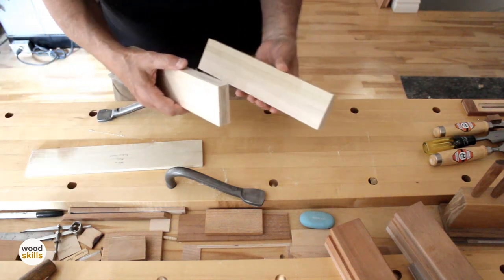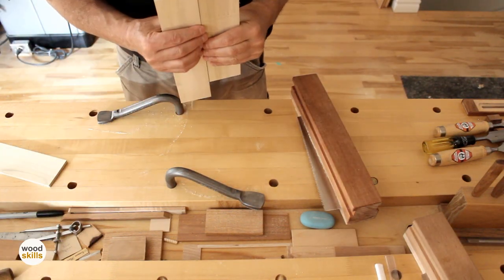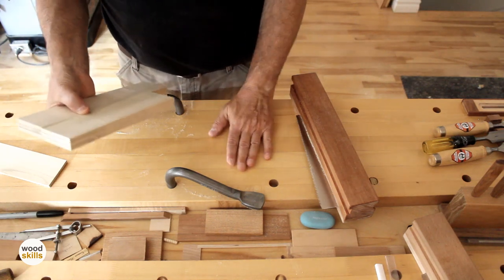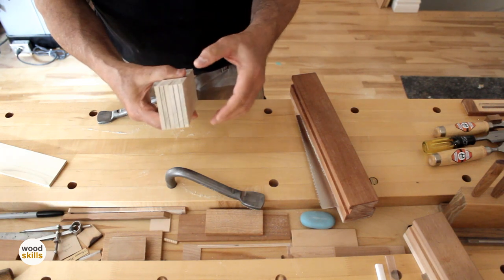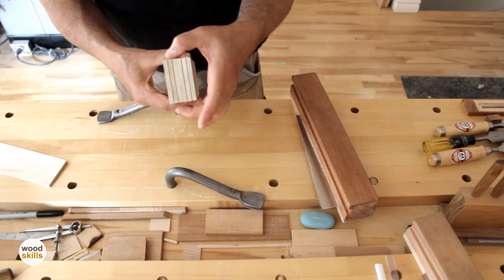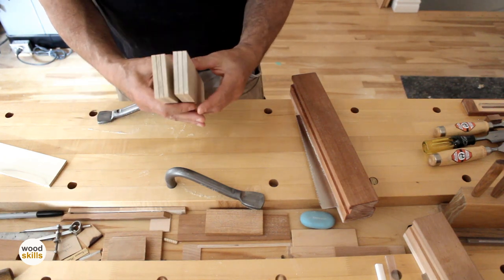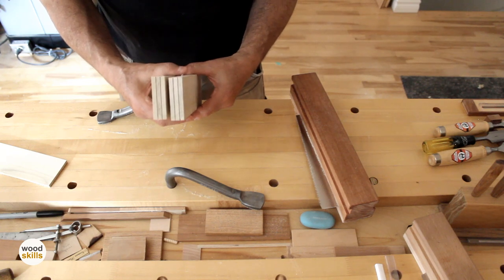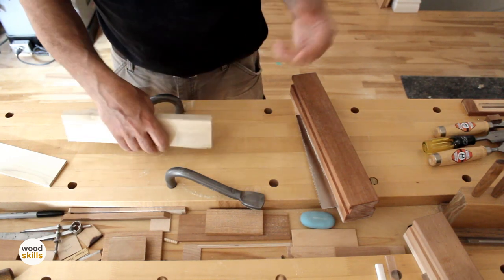So we now have both the mortise and the tenon component done. We have completed the bulk of the cuts using the miter jig saws and using my workbench surface as a reference. And these are the cuts so far. You can notice how straight they are. And you'll also notice that the tenon portion is slightly fatter than the mortise portion. So once I've completed the cuts and removed the waste from the mortise, this should slide right in at the right depth. There's a few more steps involved, but I just wanted to demonstrate the level of accuracy and precision you can attain just through using hand tools, in this case Japanese Ryoba blades and saws. So I'll continue this at the next workbench.